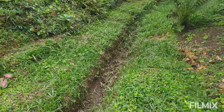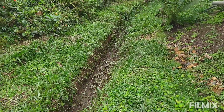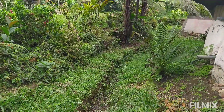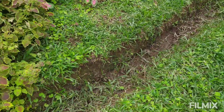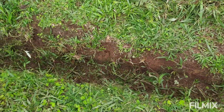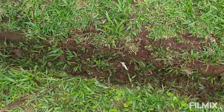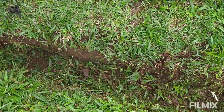We have a long earthen trench that we simply dug out with a shovel. It's about a half a meter deep and it runs up here from our road past our houses, and it shuttles all the water that we don't want going close to our house down and away. That's very similar to what you might find in an urban system where you've got gutters and they just dump it into a sewer. Well, we don't have a sewer here — we're off the grid — so we have to take responsibility for what we do with our runoff.